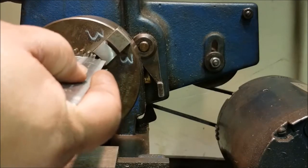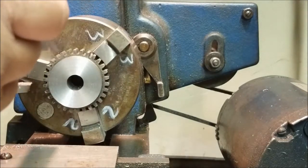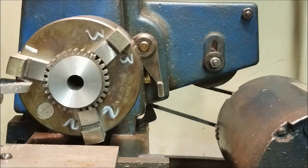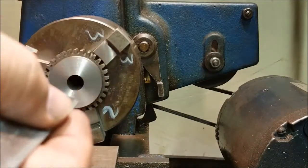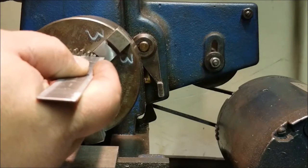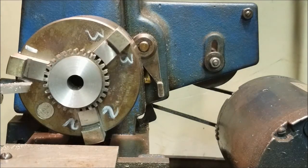I know the dimension I captured on paper was a little bit different, but when you add in the washer I made for the other side and the fact I wanted to make it a little bit bigger so it was closer to the edge of the shoulder — so there would be less end play — I added a little bit to it. So we're about right there. I'm going to take a cleanup cut and then I'll set up for cutting the diameter of the boss.